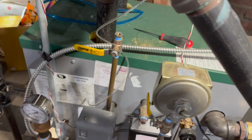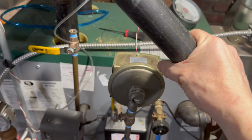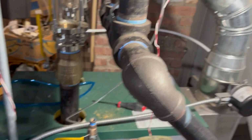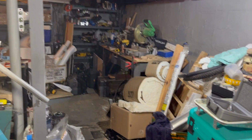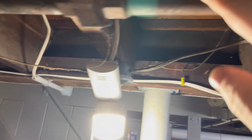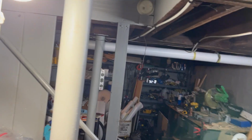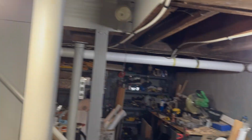Now it's my thinking that the equalizer is not what prevents the water from rising over there at the far end of the main. It's actually the main itself. If I'm running 3 PSI in my boiler, I'm going to have 3 PSI going across my main. Can we agree to set aside velocity, drag of the pipe or whatever? This is not 100 PSI steam or something. It's traveling, but I don't think it's getting skidded to a stop by the walls of the pipe here.